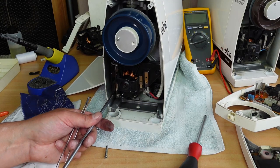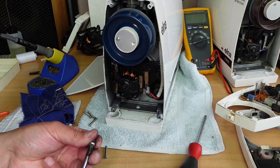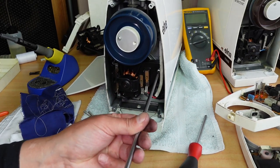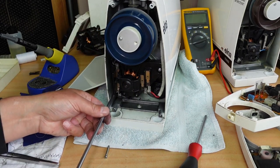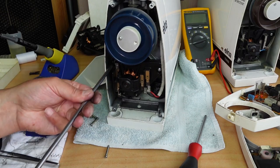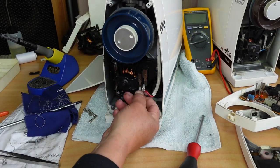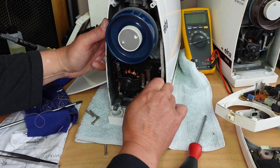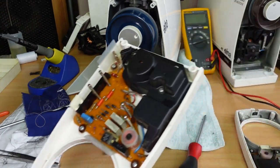Now, if I wasn't going through and explaining this in detail to you, I would probably just swap out the resistor there before I go and test this any further. But I'm just curious, and taking this one step at a time, so that if I got it all back together again after replacing the resistor and there was still a fault, at least I would know, if I do it this way, where the issue might be. That's good there. Just connect these two here. And so this way we can determine whether this motor is faulty or not, by using a good known board here.